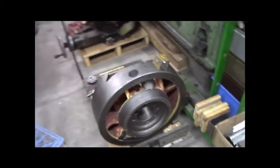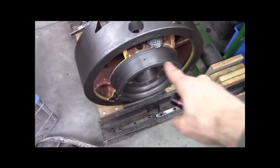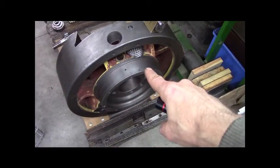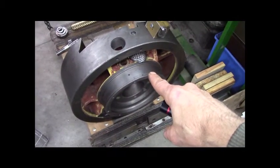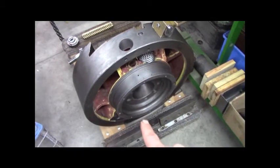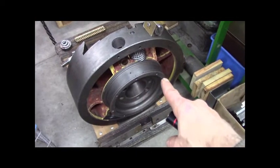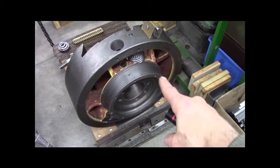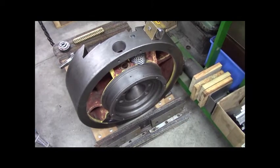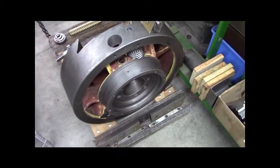These two ring gears are how the Summit horizontal boring mill worked. The coarse pitch one was the drive gear. The finer pitch with the bevel gear was the offset adjusting gear. I'm not going to use that. But that kind of answers the question you guys may have - what's this flange for? That flange was the driver for that bevel gear, and the gear with the big tooth profile bolted to the flange of that.